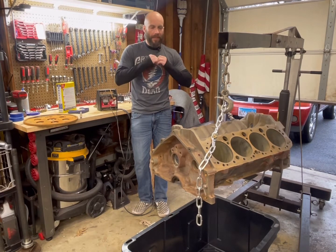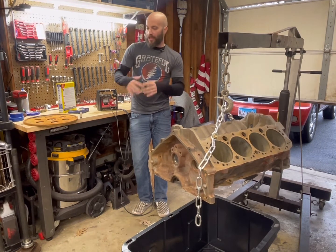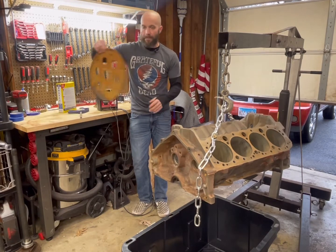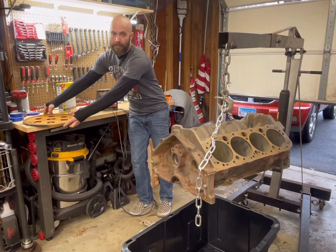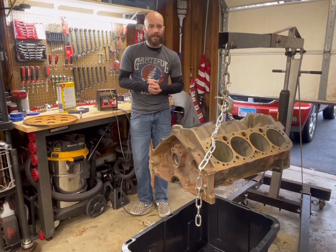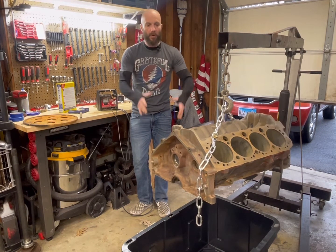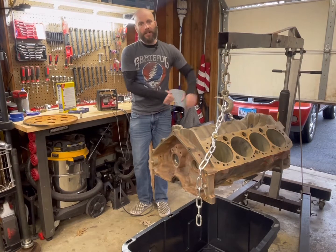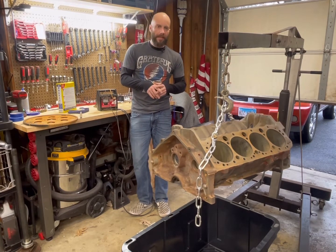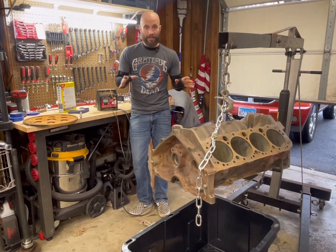You don't want to do this on aluminum. When that starts happening and breaking the rust free — bubbling and all that stuff, which you will see — it starts pulling it towards your sacrificial piece of steel. All that junk rust connects to this. This does take some time. I did this once before on this block for about four hours just to test it. Also, make sure you have ventilation — this does produce hydrogen in the process, and we don't want your shops to go boom.